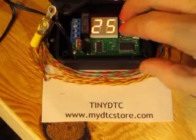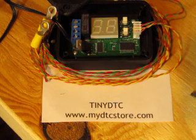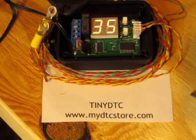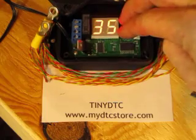It also has a low temp shutdown mode. This works the same way but with the T1 sensor. If T1 goes below the set point, it'll also disable the output. This could be used if you didn't want your unit to run when it's freezing or close to freezing — maybe you have a drain back system. That would be a set point you could use for that.